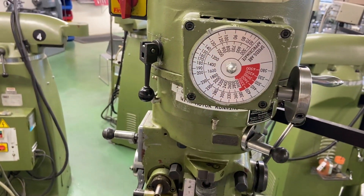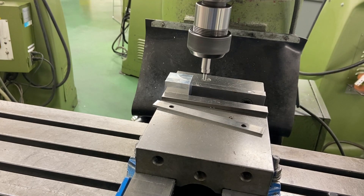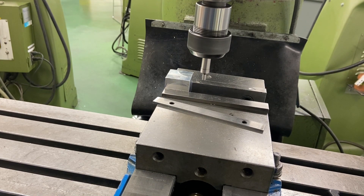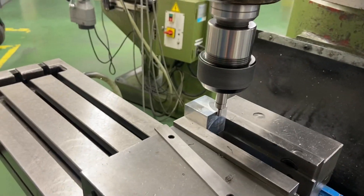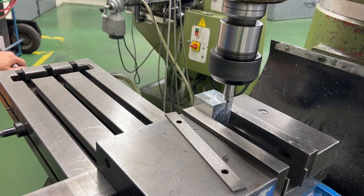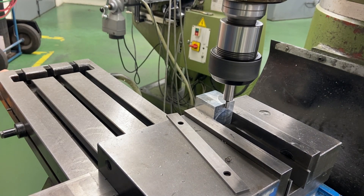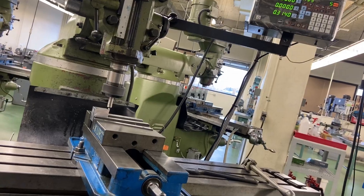I have my RPM set to a thousand RPM — that's what I want to run my edge finders at. What I'm going to do is feed in until I have it start to run true, and once it pops off you'll see it. Once I have that pop off, I'm going to set my zero here. I'm feeding in and it's going to pop off right about here — that's the pop off that you can see. So the first way is I'm just going to hit my X, Y, zero on my DRO right here, so I have X and Y zeroed out.